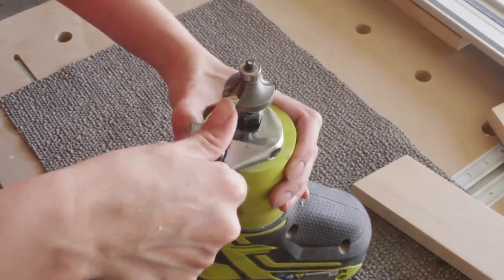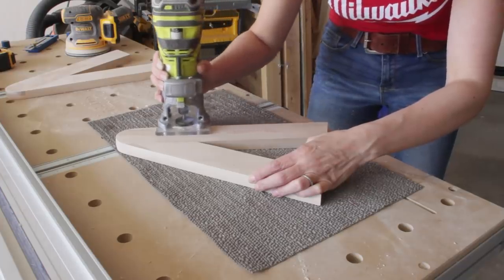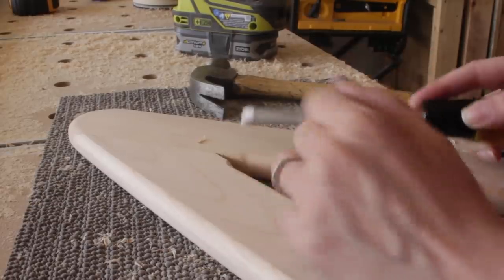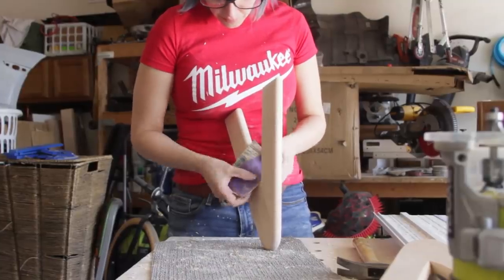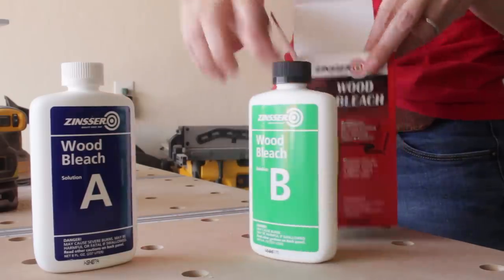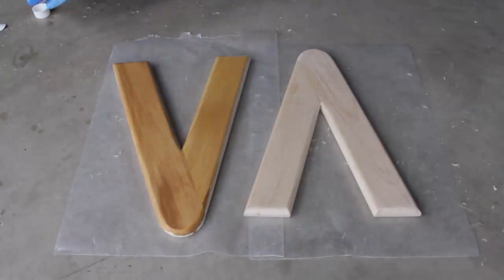Next I turned my attention back to the wooden legs. I'm on this full radius round-over kick — I did it on my stair tread chair and also my plywood dresser. I made multiple passes with a trim router to ease over the edges of both legs. The router bit couldn't reach inside the tight angle where the legs met, so I had to use a chisel and a little sandpaper to round that area over. I was feeling experimental and wanted to try something new with the finish. I'm in love with the look of bleached wood so I decided to give it a shot on this red birch. I first experimented with a homemade solution and didn't have great results, so I decided to use a two-part wood bleaching system from Zinsser.